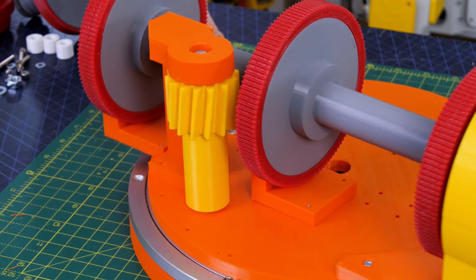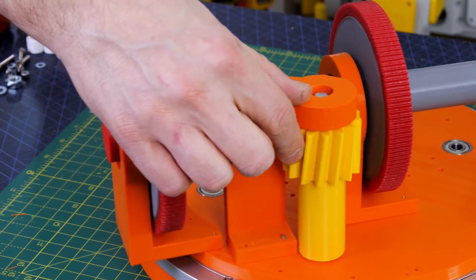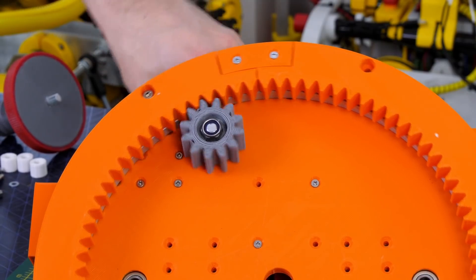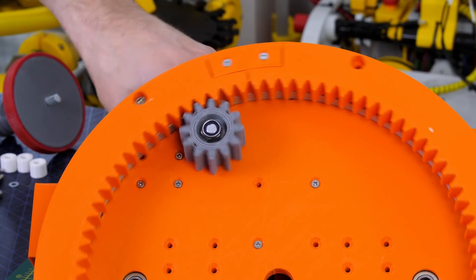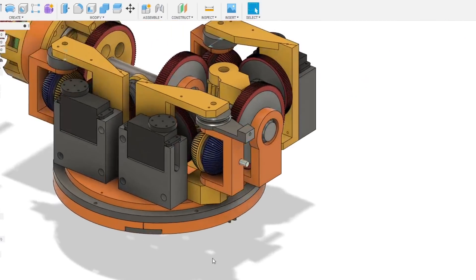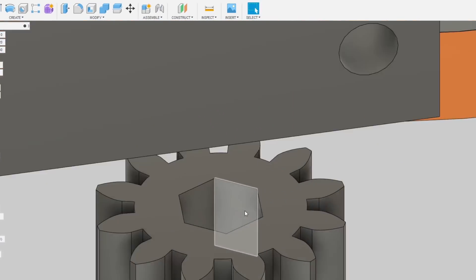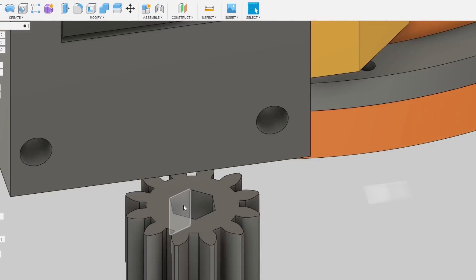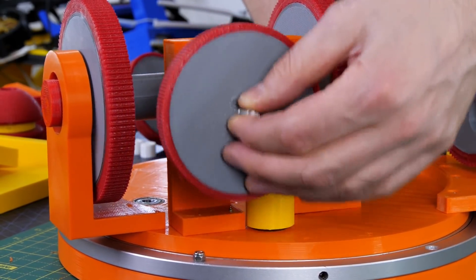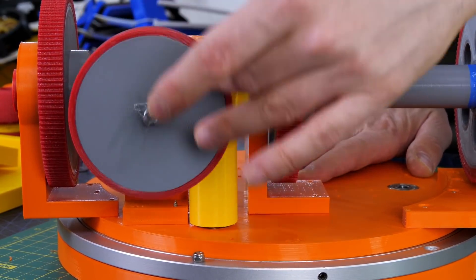I fitted the spur gear in the bottom of this which runs on that big ring gear, and that is driving another gear which is going to run on a worm gear - so that's a very slanted-looking spur gear. You can see that runs on the bottom there so the two are linked together. Basically this is mounted on a piece of M8 studding with two nuts done up on each other, and the two nuts are fitted into a hex cutout in the top of that spur gear so it doesn't rotate freely and everything is done up nice and tight. We just need to fit the intermediate worm gear so that fits into a bearing on that bracket and it runs onto the gear to make the whole thing rotate around.